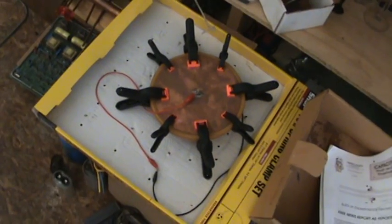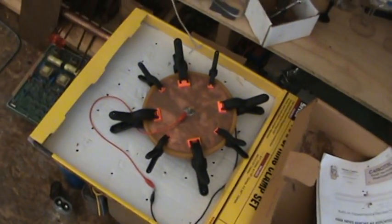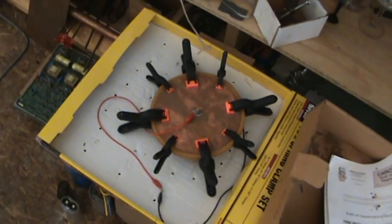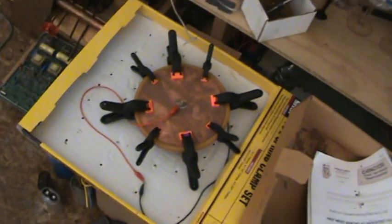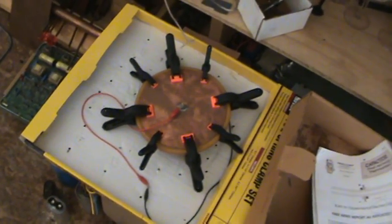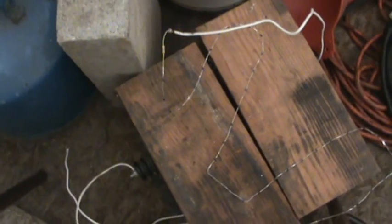Many clamps go around, and the copper is thin enough to flex and match the contours of the wax surface. After you have your wax disc, you put your copper plates on, put all the clamps on, put it in the oven, and at the same time I used that NST — 15,000 volts, 60 milliamps. The instructions just mention 'low DC current,' and I don't know what 'low DC current' means — how much more vague can you be?